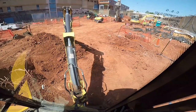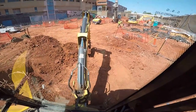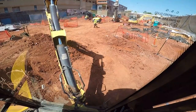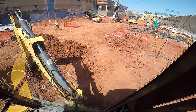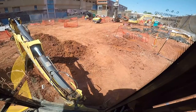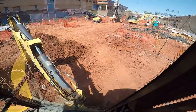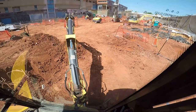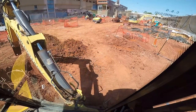These guys with the concrete truck are pouring one that they just drilled earlier this morning. And there's a tower crane up above my head they use to set those big, if you look over beyond that concrete truck, there are some big wire cages. They set those down in the piers, and they tell me they're going about 30 foot deep, so pretty good sized drill there.